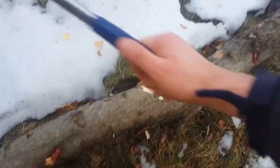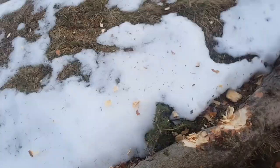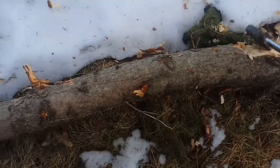It's pretty sharp. I should have spent a little more time sharpening it maybe, but it's probably pretty good. Could carve a spoon with that. Thanks for watching — hope this helps somebody. You can do it to pretty well anything: knives, whatever. It turns the rust into black phosphate; it doesn't really eat the metal in a traditional way. It converts the rust into just something that breaks off the metal quite a bit easier. If it's a lot rustier than this was, you'll have pocketing and stuff you'll have to deal with. But luckily this was just a light rusting. Thanks for watching.